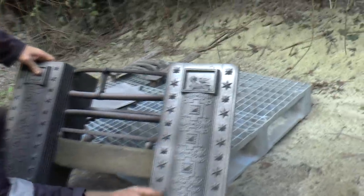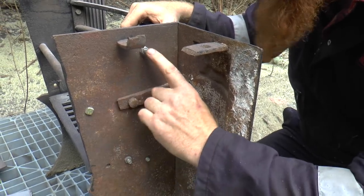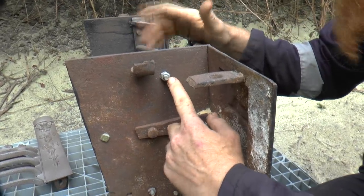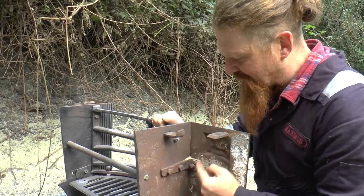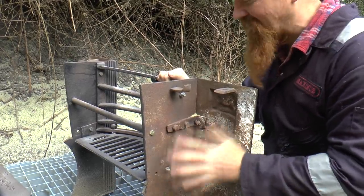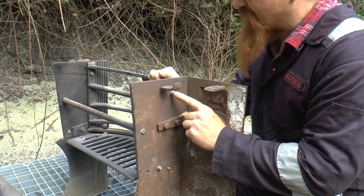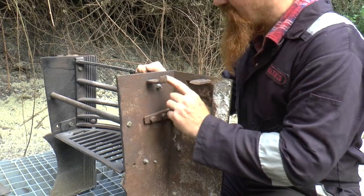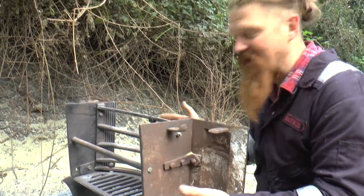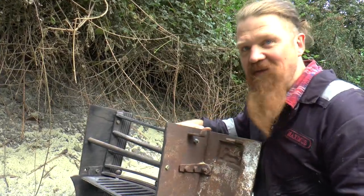See how sharply all this patterning comes up after blasting. I'll show you the bits that are questionable from whoever did this last. You can see this has been restored using brand new metric fixings, and this one here is actually a nylock — nothing authentic about that at all. Down here, this is what you'd expect to find: a hand-threaded fixing, because the blacksmith who made this would have had his own threading kit, not to any standard, with a handmade square nut on top. I'm going to take these off and redo them with my own handmade nuts so it will look a lot better.